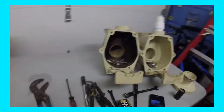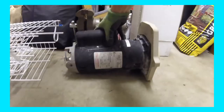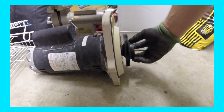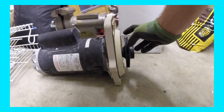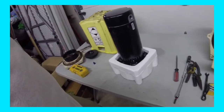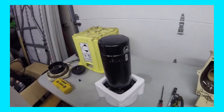I got the old pump apart. Now we're prepping the new motor to go onto the pump. Just to clarify: this is a pump, and this here is a motor. The motor turns electrical energy into mechanical energy when it spins this impeller. Technically the impeller is part of both the motor and the pump — it's the key to the whole system. When we say motor and pump, we are talking about two separate things. A little trick I use in the field: I keep the styrofoam piece from the box to use as a motor stand, so it's not rolling around on the ground while I'm working.